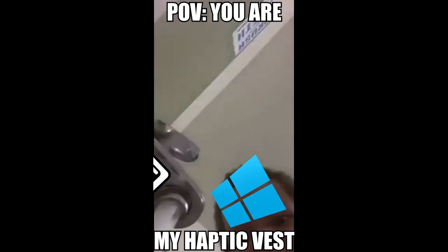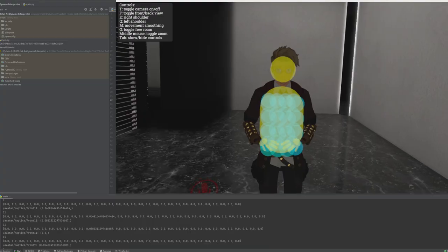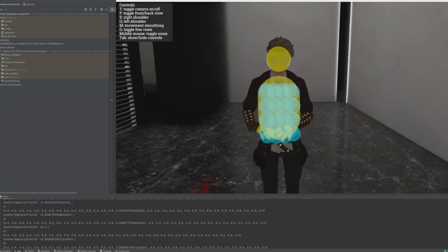All that was left to do now was grab the haptic data from the PC client and send those values to the motors they belong to on the vest. Simple enough, right? Yeah, about that. The Raspberry is being overwhelmed by the sheer amount of packets being sent by the PC client. While testing, I just barely brushed some of the colliders in game while the vest was on the table, and it kept vibrating for 3 literal minutes until it was done.